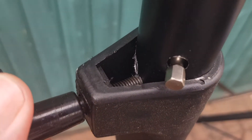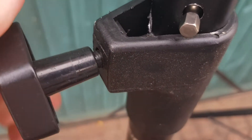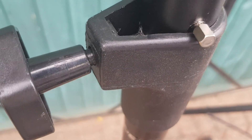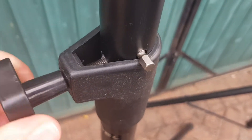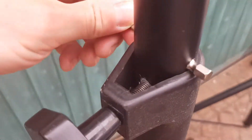That goes through there. Loosen this screw slightly so that drops — you don't want to force it — but just so that pin is secure. That's not going to move when it's tightened up. So that's now at head height, the safety pin is not going to move, and if this fails your speaker is going nowhere. That's your next step.